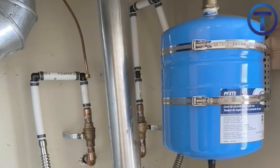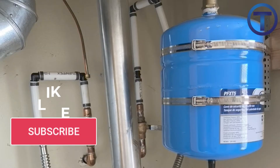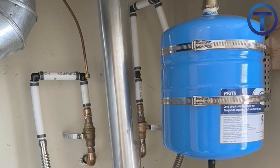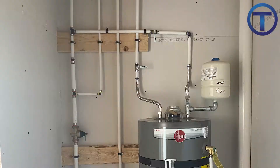Let's consider for a minute the need to support an expansion tank when it is installed. First of all, it's a metal tank and we're going to put water in it, and it's going to have some weight — it could be 10 pounds, it could be 20 pounds depending on the size. There's a significant amount of weight. Can you suspend all that weight from the supporting pipe, from a pipe that it connects to? Do you want to put the weight on that? There are some cases where that's a really bad idea, and that's why having a separate support for the expansion tank is really important — to have a strap for it.